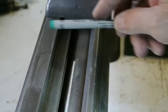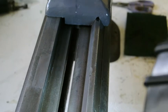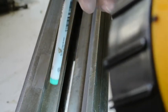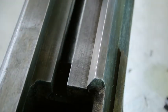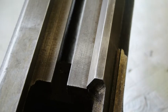Because the compound slide will be sitting on top of here most of the time and will not bear against that surface. So I've cleaned up the ways just with a Scotch-Brite and that has just taken the worst of the dirt out. You can see that this surface here is just a machined surface — nothing special about it, and nothing bears on it. Looking at this side where the headstock is, this is beautifully smooth underneath where the headstock sits — in absolutely perfect condition. But along here it's a little bit marked and scuffed, though it's certainly not bad and there's no terrific amount of wear.